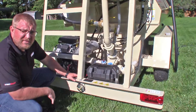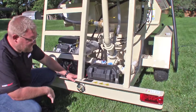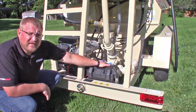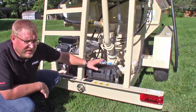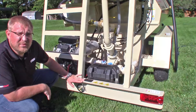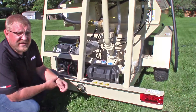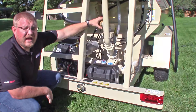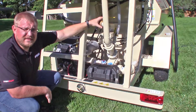The last thing you want to do for your tank cleaning procedure is remove your tank drain plug and your pump drain plug. This will allow any material that's in those two areas to drain and your tank will be nice and clean for the next time you want to use it. If you're in freezing weather, leave your ball valves open so water doesn't collect and cause your ball valves to crack because they're frozen.